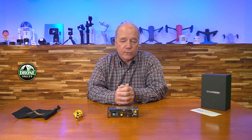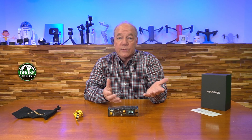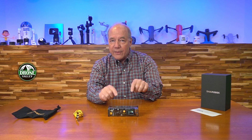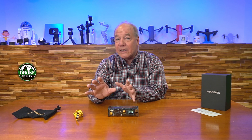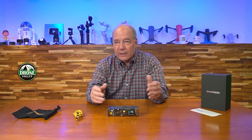If you're heading out and need power to charge your laptop, that's just great. The unit has a series of connections on the end: two USB-C connections, a single USB-A connection, and a barrel connection. USB is a charging standard that's been around for a long time — the original standard was USB-A and a lot of products still use that. This USB-A connection is also a QC connection, which means it's quick charge compatible. If you plug in a QC-compatible device, the unit will recognize it, interrogate the device to figure out what voltage and current it needs, and adjust accordingly to quickly and safely charge it. It's smart enough to look for QC devices and quickly charge them, and it'll work fine for non-QC devices too.